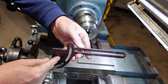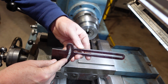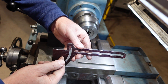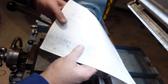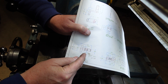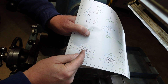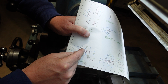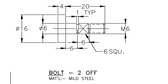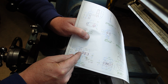To join this banjo onto the supporting bracket there are some interesting bolts. These slots are 6 wide and on the bracket there are some square holes that are also 6 millimeter square, nominally. Then there are some nuts on the back to tighten everything up. The drawing calls for M6 - the drawing says quarter AF but it's actually 6 millimeter AF - and there are some grooves in between to separate. I'm actually going to make it without those grooves, partly because of extra fiddliness but also because I don't have a 1 millimeter grooving cutter.